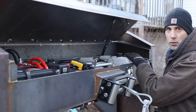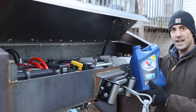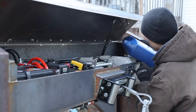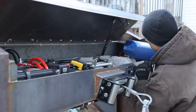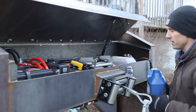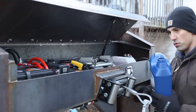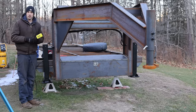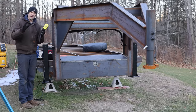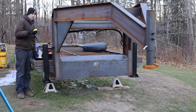When it comes to filling this thing up with hydraulic fluid, there are actually a bunch of different types you can use, but I'm going to go with ATF — this is a Dexron 3 ATF. It's cheap and readily available so it'll make a great choice. It's not quite a full gallon but it's most of one. I'll run it and keep an eye on the level — I'm sure I'll have to add fluid as it sends fluid to two jacks. I also have a wireless control unit included in the kit so you don't have to be constrained by the wires, but I haven't hooked that up yet. This controller is actually magnetic — that's pretty neat.